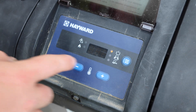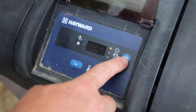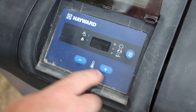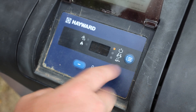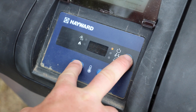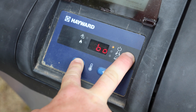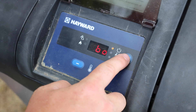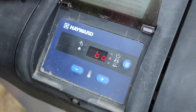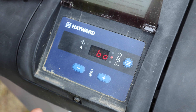Open up the display — we've got our light lit up next to the power icon. If you push the mode button, you can cycle through spa, pool, and then the power icon. With the light lit up next to the power icon, hold the mode button and the minus symbol both at the same time for about five seconds until the heater flashes B-O. Push the mode button one more time to put it in either pool or spa mode, and now it's ready to be controlled by an OmniLogic or by any automation system.